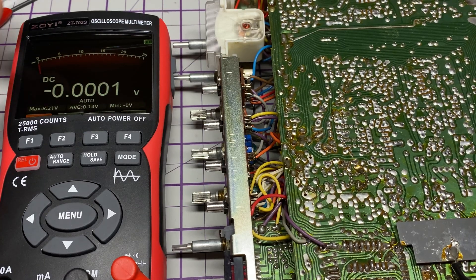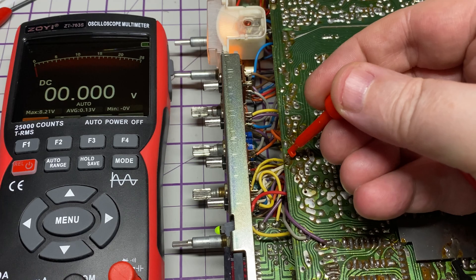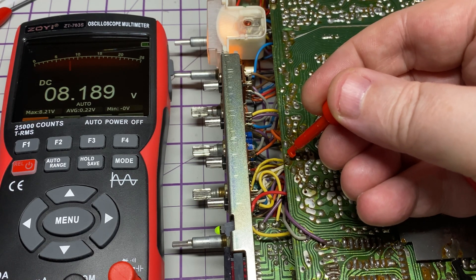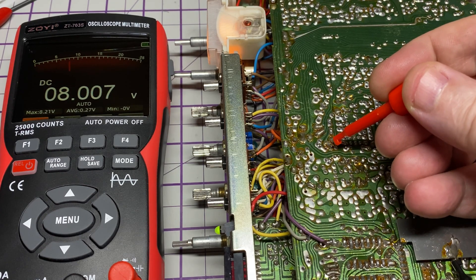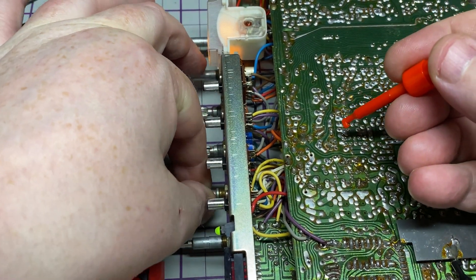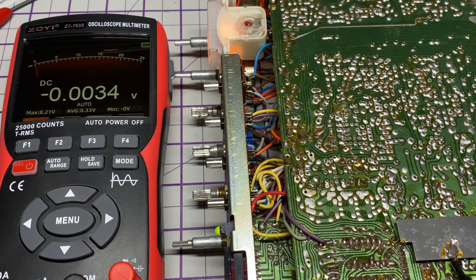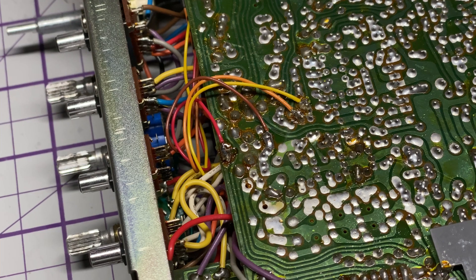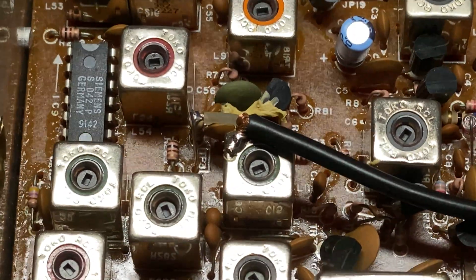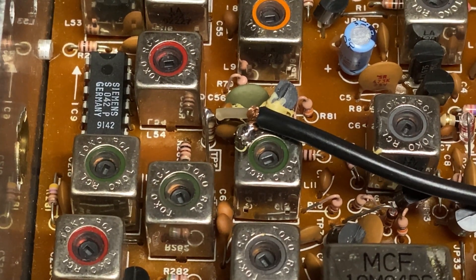Once that's soldered back in, we need to find an 8-volt supply, which should be the rail right at the very front — and sure enough, there's our 8 volts. That will be our main supply for the counter. We also need to find USB and LSB 8 volts, which is normally around this area — we'll just find it with the multimeter. There they are: our USB and LSB voltages. So ground, USB, LSB and power are connected up nice and neatly, and the signal for the frequency counter comes off TP3 and runs out to the socket.